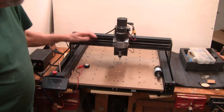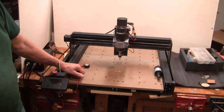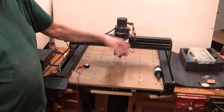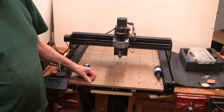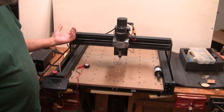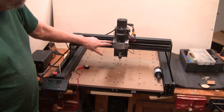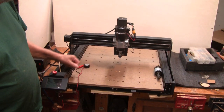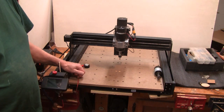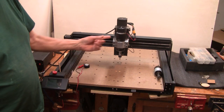This is what drives it back and forth in the X-axis — it's like an acme screw with a nut back there. That brings up one issue I had. When I got this, there was over an eighth-inch of slop. When you're cutting something with an eighth-inch of slop, your part's not going to look all that good. I contacted them and they sent a picture of probably what I needed to do — so obviously this has been an issue. I had to take it apart, and the nut that the rod goes through was fastened to the mechanism but the screws were really loose. On the assembly line they need to tighten those a bit more, maybe put some Loctite on them. That's what I did — took it apart and fixed it. No big deal.